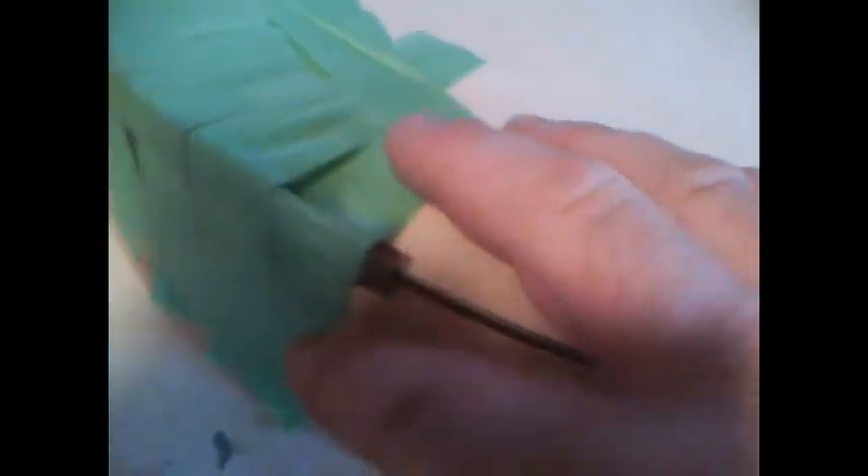You can see I'm using a lot more tape just to make sure it's good and secure, and again I'm just using super glue. Once that's dried and in place, you want to scrape and sand it flush with the sides and the top. A good cabinet scraper works here, or you might want to start with some sandpaper, but this will give you a very nice binding edge. Notice we're just doing the top for right now — this is so we can attach the neck without having to work the binding around it later.